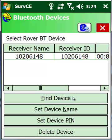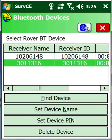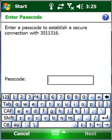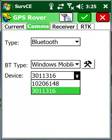Find our receiver by telling it to find device. My base is still in that list and will be there unless deleted. It'll go ahead and look through for our rover receiver. Once found, we pick the receiver, tell it to Bluetooth connect, add it to our device list by putting in our password — this means we'll never have to redo this step. It'll always be in our dropdown list. Once it connects, tell it we're done, hit the pigtail icon for power to the receiver, and get successful connection. Now in the dropdown list, I have my two receivers.